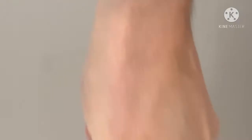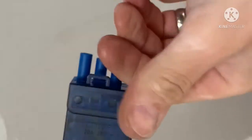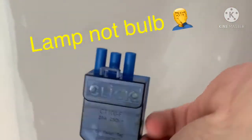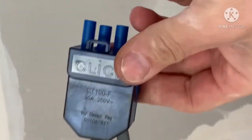The cover clips into place and then you plug the fitting in. If there's a faulty fitting, for isolation purposes you just drop the outgoing side out - that eliminates the fault quickly. With LED there are no bulbs involved, so nine times out of ten when a fitting stops working it's the LED driver that's packed up. The client can simply unplug and re-click the connector themselves - safe as houses. It saves a call-out for the electrician. Maybe doing myself out of a couple of quid, but these are just so practical - really good.